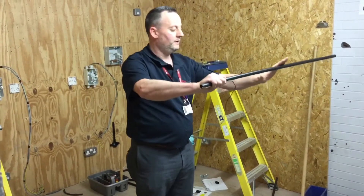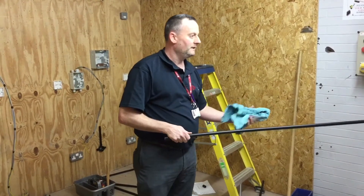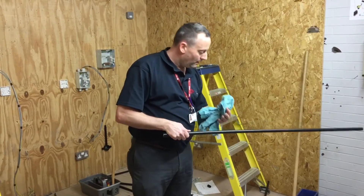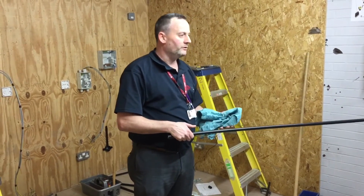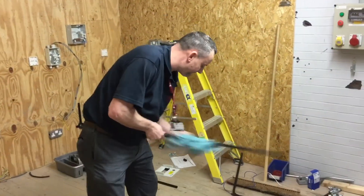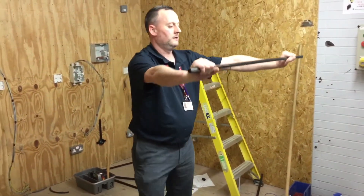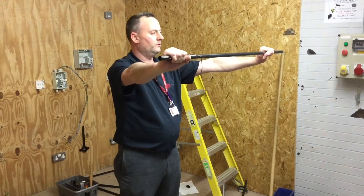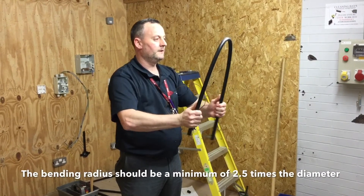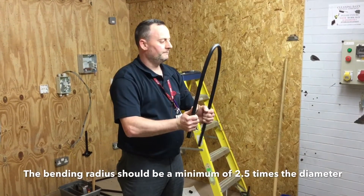I'm going to put my 90 degree bend in this part of the PVC conduit. We mentioned warming it up beforehand to try and prevent rippling of the spring through to the outside PVC. We know the cost of this conduit is very low, so we are still getting a little bit of rippling. We warm it up along the full length, and in this case we use our knee as a large bending radius, bending it — come in, back out, come in, hold, and back out.